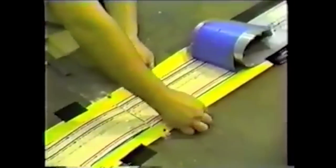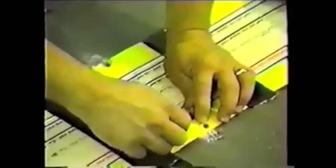Temporarily cross-tape both cables at the back of the perforation to hold the cables in position to accept the splice connectors. Observe the phase color marking on the 2 matching conductors to be sure the cable has been installed correctly, and install a splice connector on the 2 conductor ends. Using the Undercarpet Pro Crimper tap and splice hand tool, terminate the splice connector on both ends. Install and terminate only 1 pair of conductors at a time.